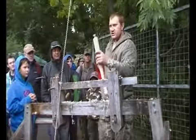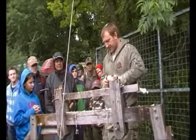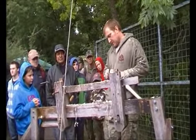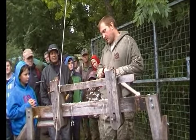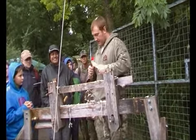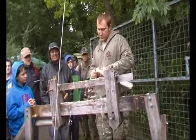So we'll take that off the lathe, disconnect it from our very noisy generator, and then we're just going to use a sharp knife to score around those fibres, and then we can just pop that off. When you're using a knife like this cutting back towards yourself, always make sure you keep that thumb tucked well out of the way. A big no-no, using your thumb as an anvil. Yeah, shows up terrible on the old ash, the old red stuff. So we'll just score those fibres.